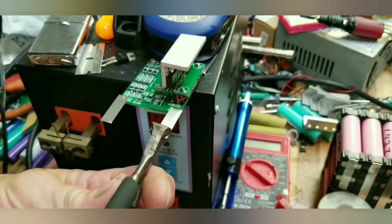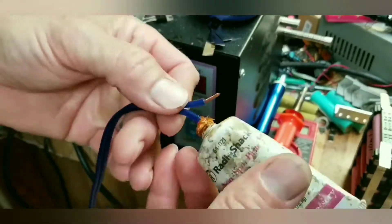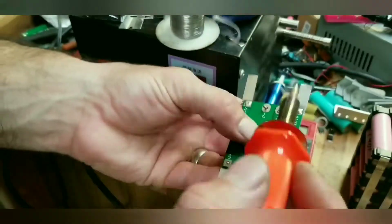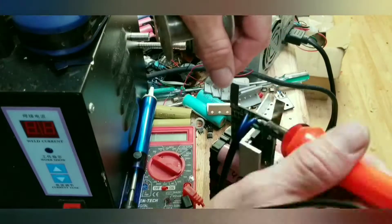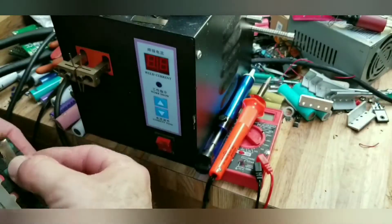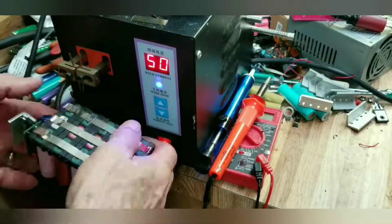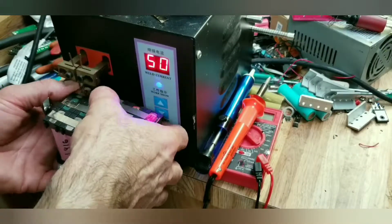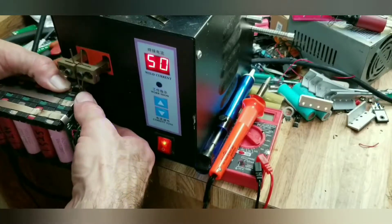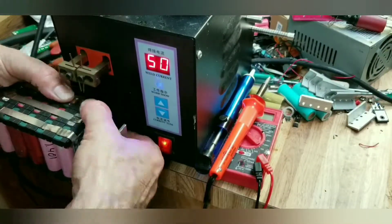Getting the fourth one done — it wasn't sitting down real nice at first. Now the BMS is almost ready. I need to connect the output wires now because you won't have access after it's welded to the battery pack. These little black framework pieces work nicely — when you get everything on, it's a very tight, nice unit, and you wouldn't be able to slip the wires in for the output after. I'm using the thick 0.2 millimeter nickel strip on the BMS, then taking a strip of 0.1, welding it to the BMS's nickel strip, and welding that to the battery pack nickel strip — kind of like a band-aid strap over the top. It welds tight; I've had to take this apart before and it does not like to come apart.